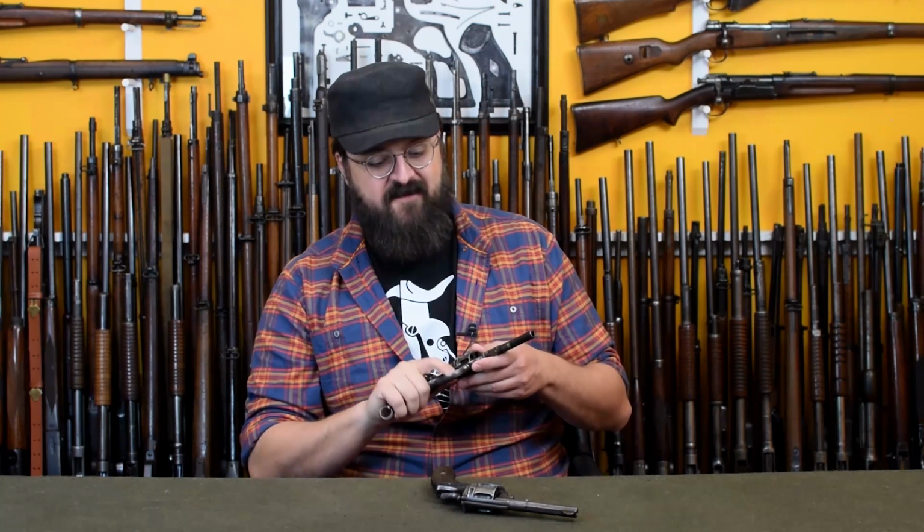Small problems with the Tornell system. Alright, if we want to load or unload our gun, we can't just roll the cylinder, it's blocked. You have to gently pull the trigger while loading or unloading in order to rotate. That's not good. It also meant that, because again, cylinder cannot rotate without pulling the trigger, you couldn't cock single action unless you rode the trigger a little bit first. That's an even more concerning issue in terms of booger hooks and bang switches.